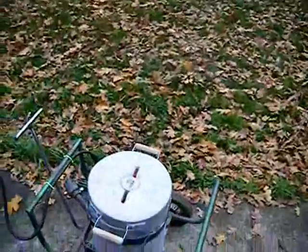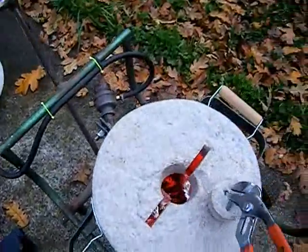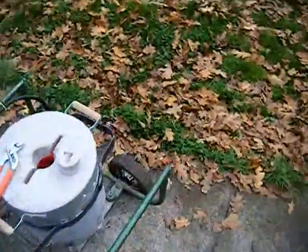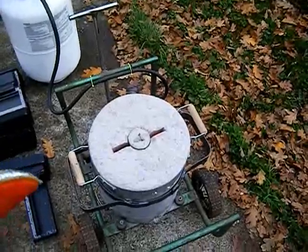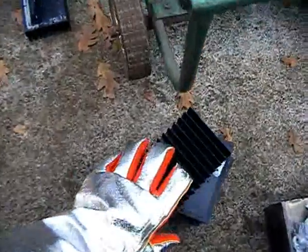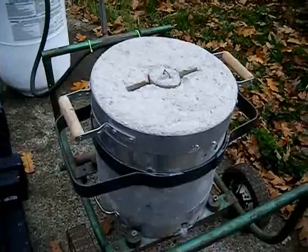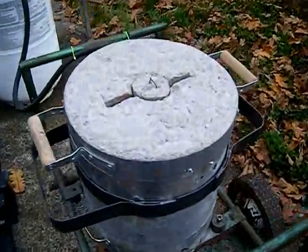Now if you're wondering what dross looks like inside — here's the heat sink I'm melting down. I'm going to lift the lid and show you what happens when you melt the anodized coating — the black stuff or whatever color you have on top of the aluminum — because the aluminum oxide, or the anodizing, and whatever other impurity, usually melts at a much higher temperature than aluminum. So let's take a look.